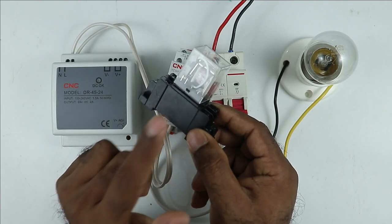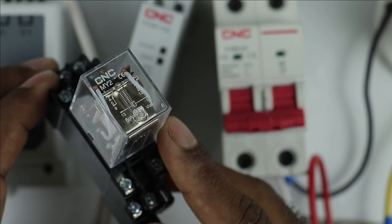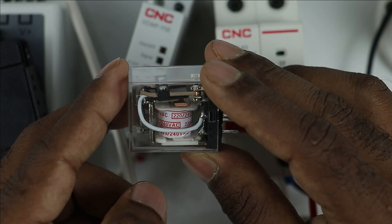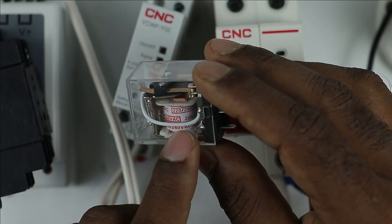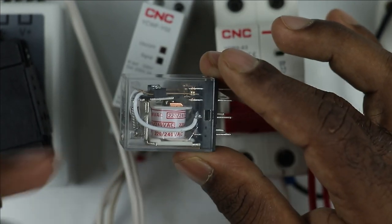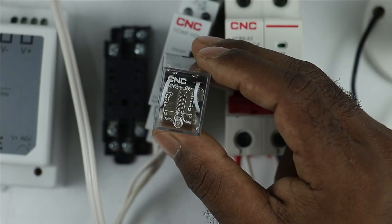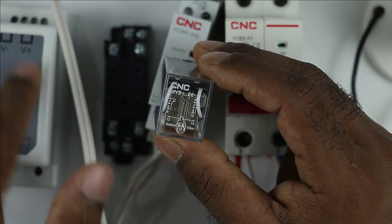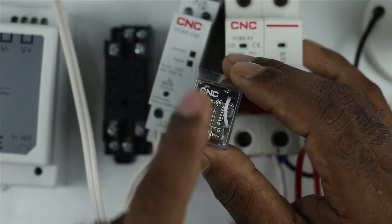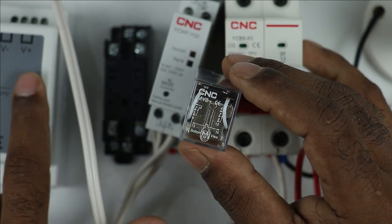Before performing connections of this relay, let's look at the operating voltage of the coil. This one is written 24 volt DC — to operate this relay we have to provide DC power supply, so we cannot use this one. I have another relay here that is written 220/240 volt, which means this relay will work on AC power supply, so I am going to use this relay. In this relay, there are two NO/NC contacts, so I can connect both positive and negative and control them. If only one NO contact was present I could control only positive, but with two NO/NC contacts we will control both positive and negative power supply.